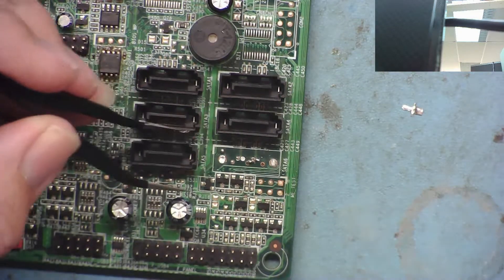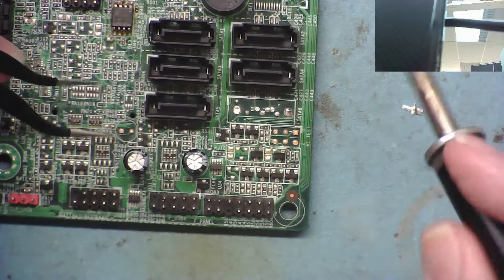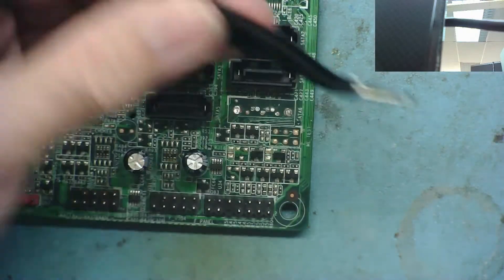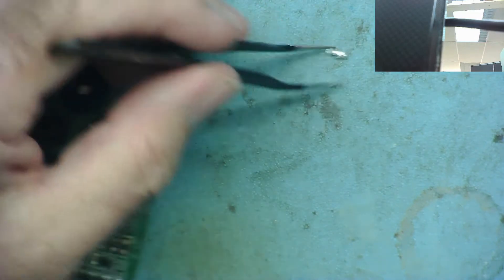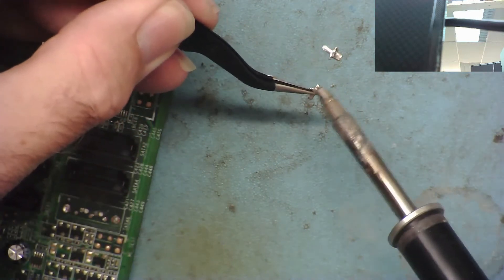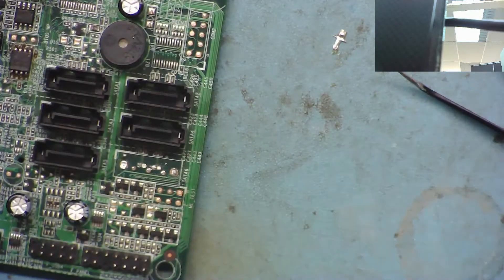The remainder of the pins are stuck in the holes here - these are effectively just bits of solder. When I removed the other connector I didn't actually snap any pins; I just lost the two at the end which obviously pulled out of the socket. I could have actually desoldered those and fitted them back into the socket, because I don't think they broke - they just literally pulled out of the plastic housing. So if I'd realized what happened yesterday, I could have extracted those and stuck them back in.